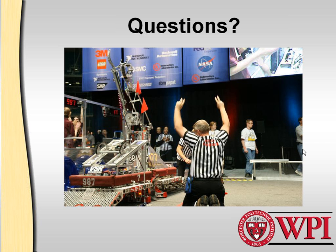You want to do that testing with the whole robot, with all the weight. How many teams build a functional driving robot at week four, and they get all the driver packs on there and forget to ballast the robot up? If you do that, you're learning the wrong stuff. We insist upon our guys putting steel plates on. You don't have to think about it. You need to get the robot to the condition it's going to be driving in when you test all of that. Absolutely. Thank you.